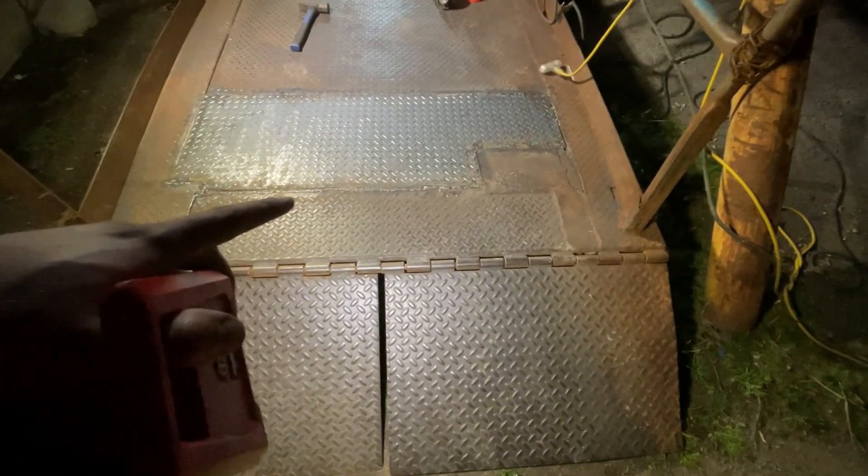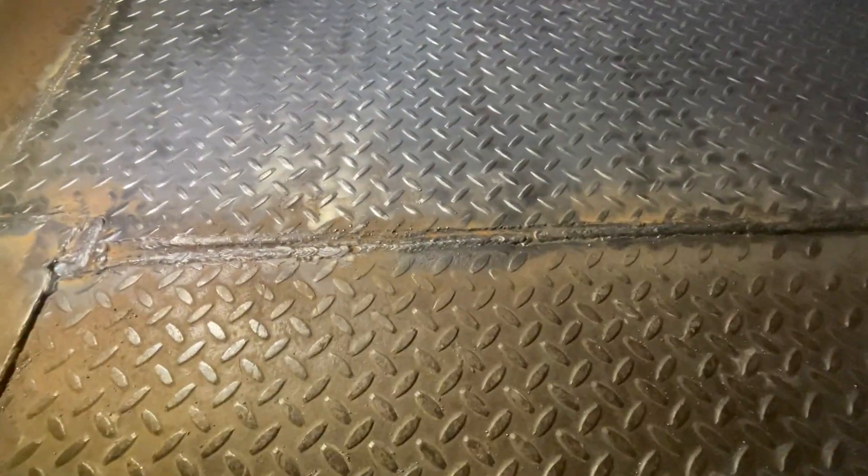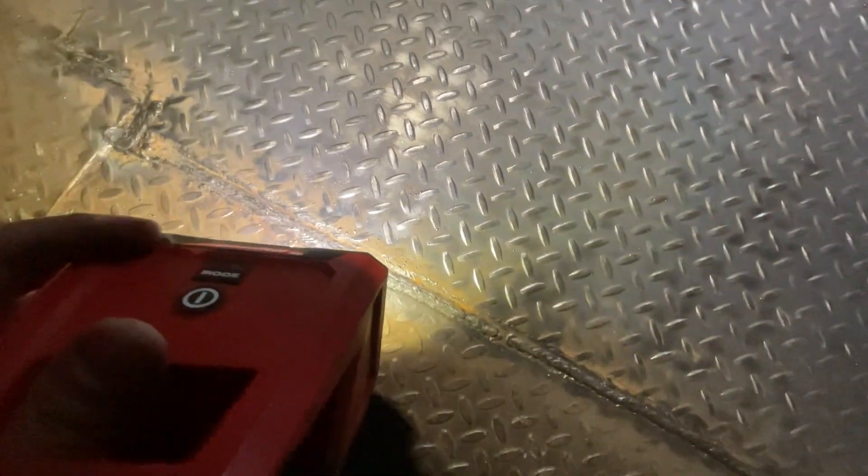I don't know what they used to weld this stuff in, but it was like I was gouging into it, and then the plate was wearing away. I pretty much burned some holes in it. Then I did some cover passes and some build-and-fill passes — they weren't really cover passes, more like build-up. So now there's some more metal there.